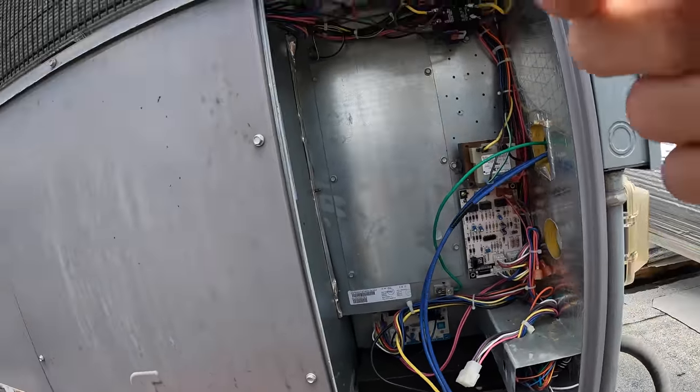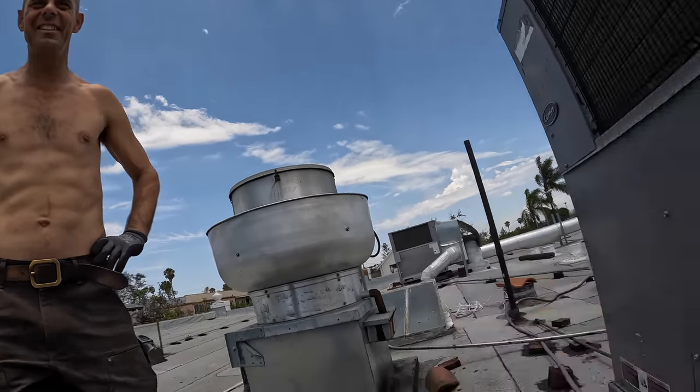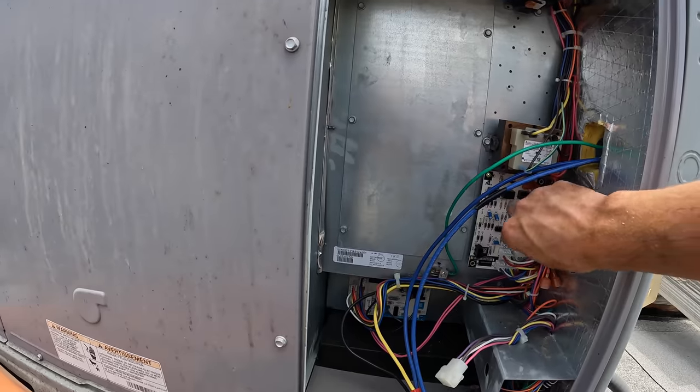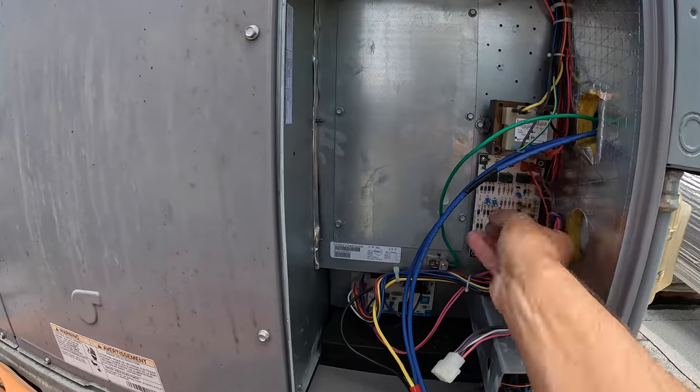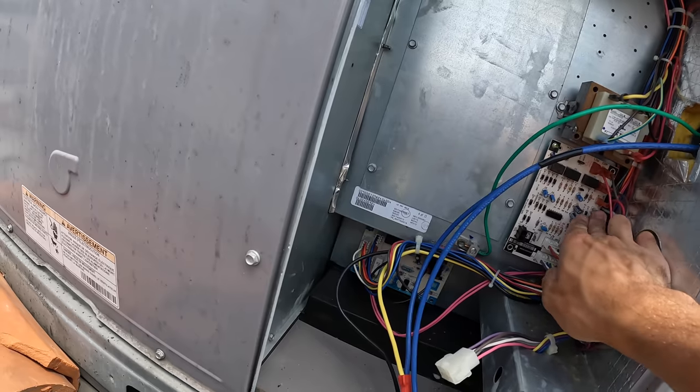Okay, I turned the power off too. She looks blown up, dog. So you think this is the problem? Stick a new 3 in there, man. Okay, well, I'm gonna stick a 5 in there because that's all we got, and we're gonna hope for the best, even though it says 3-amp on here. I mean, what could go wrong? Should you just go get a 3? I couldn't find a 3. Try 5.